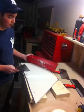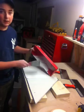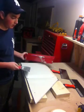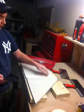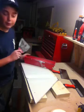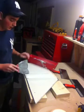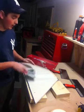Now, if it slides, which most of the time it will if it's a smaller joint, you can use the pan that the mud is in to hold it so it won't slide, and all you have to do is embed it. When embedding it, you're making sure that the tape is applied to the wall surface and the joint compound. Paper is basically not going to go anywhere once it's dried. And you want to embed it like that. Now, if you'll notice, it's still wet, and the tape can still come out, but you have to let it dry at least overnight.